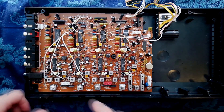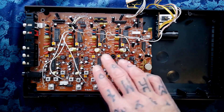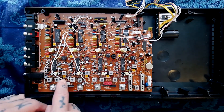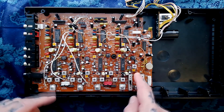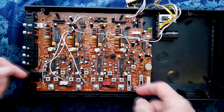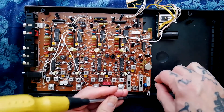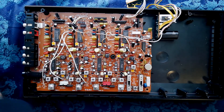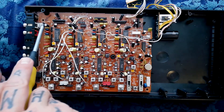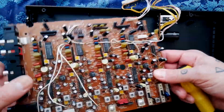Should you need to calibrate the record and playback amplifiers, these little yellow trim pots are what you need. Record amplifier gain: these four are for tracks one, two, three, four respectively. Playback amplifier gain: one, two, three, four respectively. If we need to replace components, we need to get this board separate from the case below it. There's one screw here with a cable tie — I've written 'C/T' there in Sharpie to remind myself the cable tie goes back there. Going around the edge: one here, one there, one in the center, one in the corner — that's all of it.